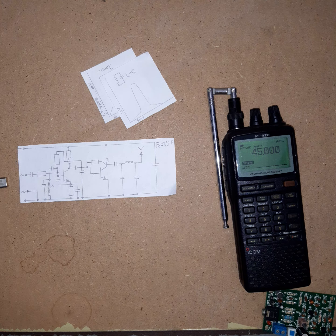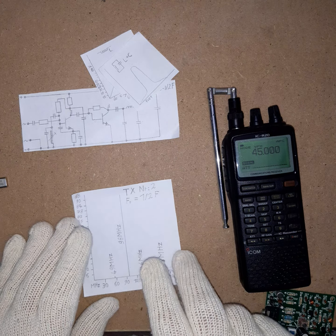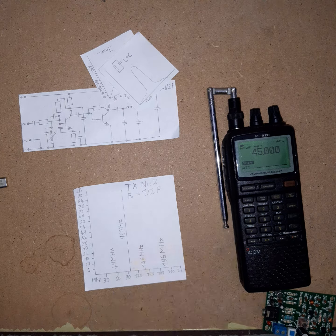It's actually quite good. I think this is the one that has the most clear spectrum from these frequency multiplying transmitters. 49 megahertz, no bars. Still, I could hear the signal in the static, I could hear it very clear, but not strong enough to get any bars on the S meter. 98, very strong. 2 meter amateur radio, not really a signal, just the first harmonic.